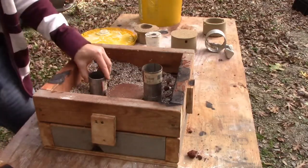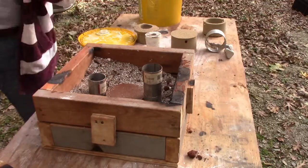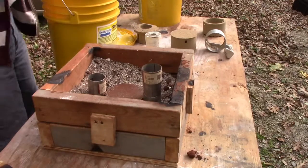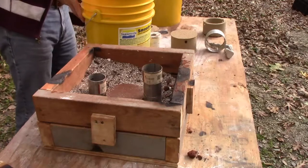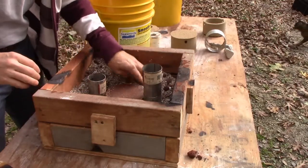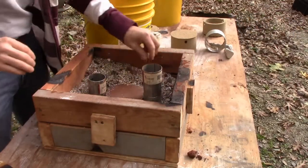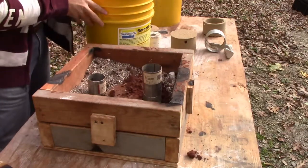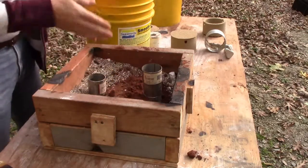I know it sounds like a waste of Petrobond. I don't like doing it either, but it makes it fast. Okay, so Petrobond. After a while, your Petrobond's going to get nasty anyway. So I tend to separate my Petrobonds into different grades. So the stuff I've been using for quite some time, I kind of separate from the other stuff.